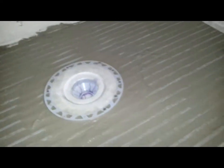That's just regular unmodified thinset filling up the grooves, and once that dries it'll be like standing on a concrete slab. We've cut some little fur strips that are the same height as the floor out here and we'll run those all the way around the shower to use as a screed board. We'll screed from those to the drain and that'll give us an even pitch. We don't need one on the entry side because we'll screed right to the outside floor. When we lay the floor tile and the shower tile, they'll be level because both substrates will be at the same height.